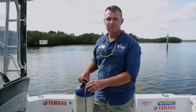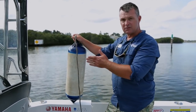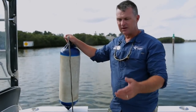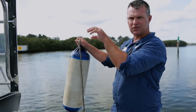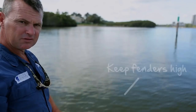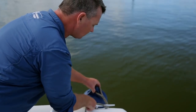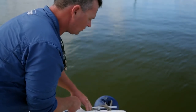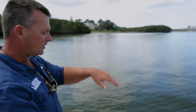First step: get the fenders on. It sounds silly, but decide what side of the boat you're going in — whether it's port or starboard. In this case, current's running out, so we're going to come in on this side because I like it on the driver's side, so I have better control. When you're tying your fenders off, tie them off so they're nice and high. Don't let them sink down too much — you want it fending the boat. If it sinks down too much, it'll sit underneath the boat.